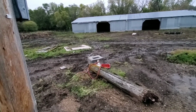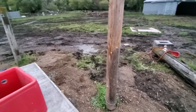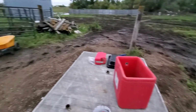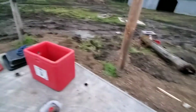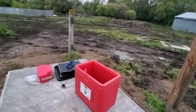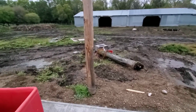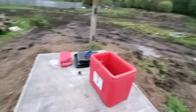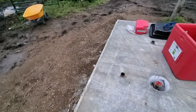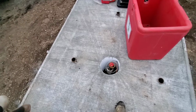So there was really nothing for the cows or horses to stand on, and between them slopping water out and the horses and the rain and moisture and snow, they pull a whole bunch of dirt away, and eventually that thing started to lean down to the east here. Also, the amount of water we were going through made it evident that we had a leak down below. So we dug all this out down 7 feet with a bobcat, where the spigot goes down, and replaced that.